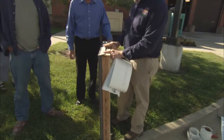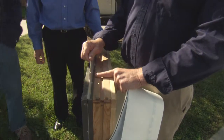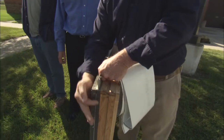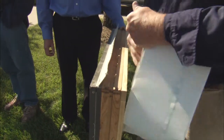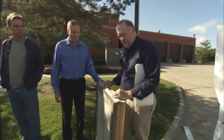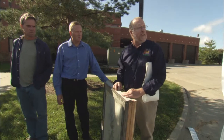They're shipped with this nailing flange nailed down in the box, and then they pop up like this so they nail in the opening. When you have this nail flange on the side, you have this void right here. The bad thing is, as many times you move these around and go back and forth, like any plastic — especially if they're sitting outside — they dry up and then they snap off.